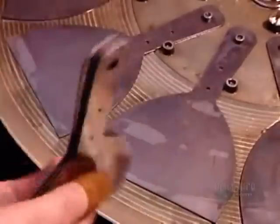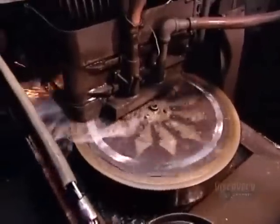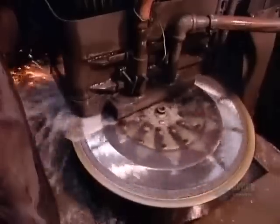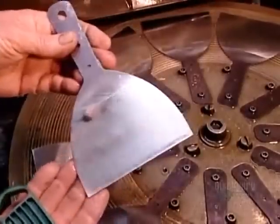Now that the metal has the required properties, the blades need the right profile. A worker lays them on a magnetic plate that angles them downward. The plate spins, running the blades against a grinding wheel. It takes about 30 seconds of grinding to profile each blade and form the flex point, the thinnest and most flexible part that's 3.8 centimeters from the end of the blade.